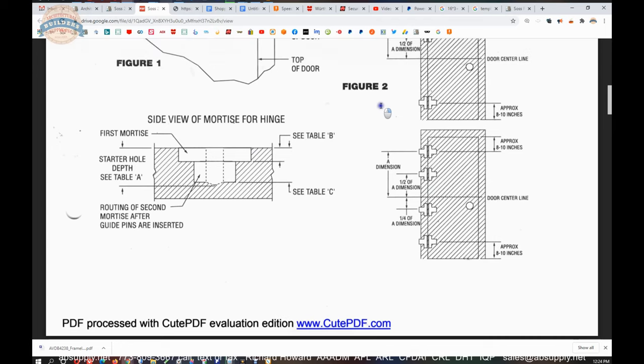But we've also used SOSS hinges for extremely heavy doors. We have done a SOSS, a 16-gauge hollow metal door, 3070, with 3/4-inch laminate, 3/4-inch granite that was applied. And I couldn't tell you the weight of that door.